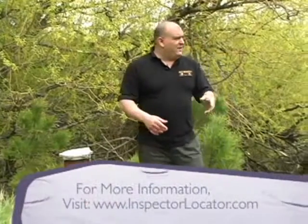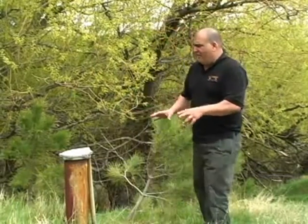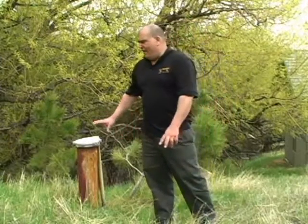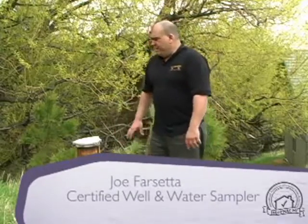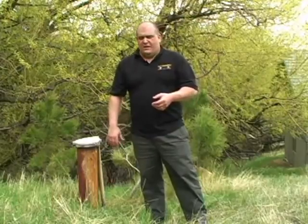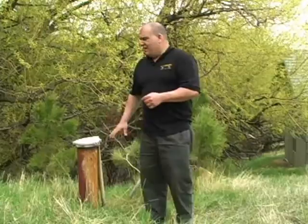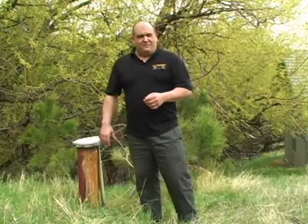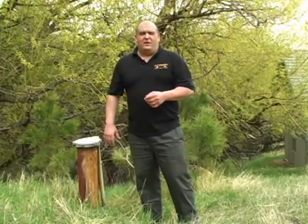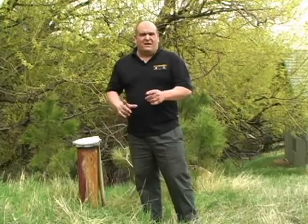What we also have here on the property is some severe inclines where a lot of runoff is heading this way, so we want to be particularly careful when evaluating the pitch around the wellhead. Another important thing to note when inspecting wells is the distance between the wellhead and any sanitary system on the property. There's no city sewers here — we're very rural. There is an on-site septic tank with leach field, and there is a relationship between human waste and how it can affect water quality. In this case, this wellhead is more than 100 feet away from the septic field — that's an important thing to note during your inspection, and it's important that the well be installed according to state and local guidelines.